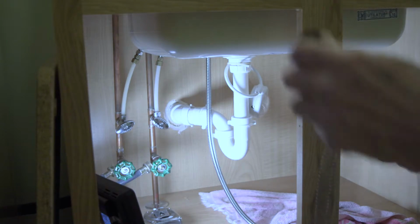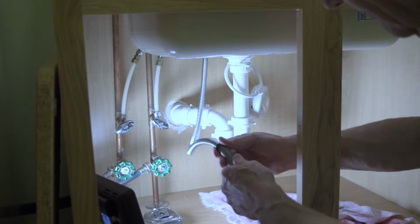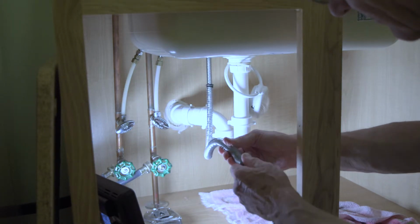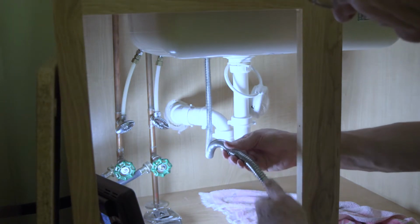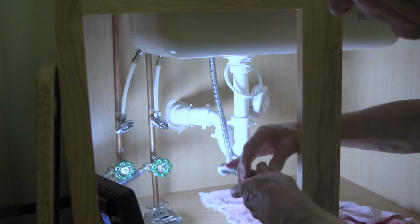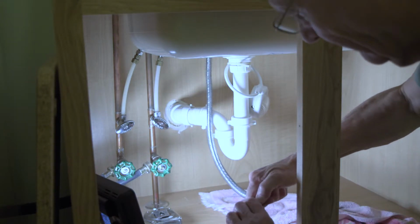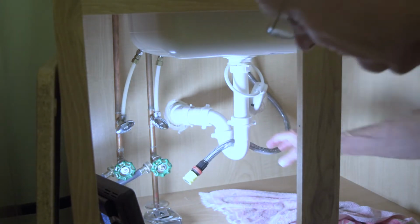Now this spring goes over that flexible hose so it'll retract into the faucet. And I think a lot of companies are using a donut that slips over that hose, a plastic donut with a weight in it, and that slides up and down the hose to keep retraction force on the sprayer. But this one, you got this spring, you got to compress it on this hose. It's kind of hard to do because once you start threading it on, the spring's in your way and you can't get a grip on the pipe or the flexible hose. But we eventually get there. And fortunately, there's a nice rubber seal in this, so you just have to put it on and give it a hand tight. And we'll get at snapping that on once I get it untangled under the sink and where it ought to be, I'll hook it up to the bottom of the faucet.